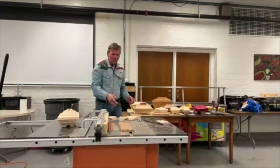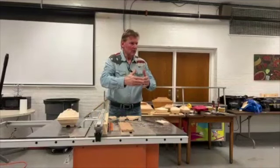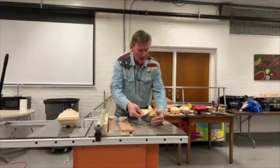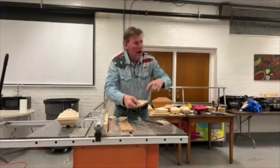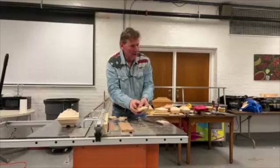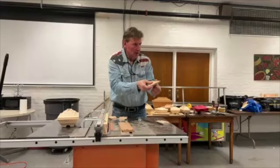And again, when you make your first outside angle cut, hold them together, hold that top, that little measurement when you sight down tells you how much of a gap you're going to have. Because like I say, we had 2.5 inches. So if we made the box 5, we know that these would touch. If we made it 5 5/8, we know we're going to have a 5/8 gap. So that's how you play.